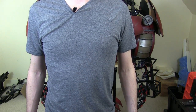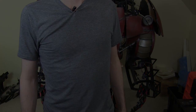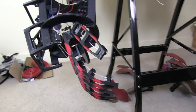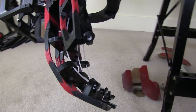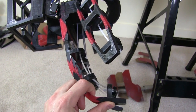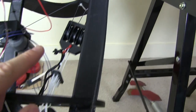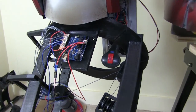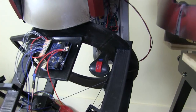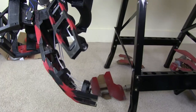My T-shirt this week is of course a picture of the sky on an English summer's day. So here is one hand — this has been made with ABS printed parts and the red parts are NinjaFlex, so these joints flex and they're pulled by nylon 3D printer filament cords which go to a block and tackle, which is pulled by a motor. All of that is controlled by an Arduino, the joystick in the upper arm, and some other electronics. That joystick controls the entire lower arm and also the shoulder weapons. But for now we're going to put some panels on the fingers.